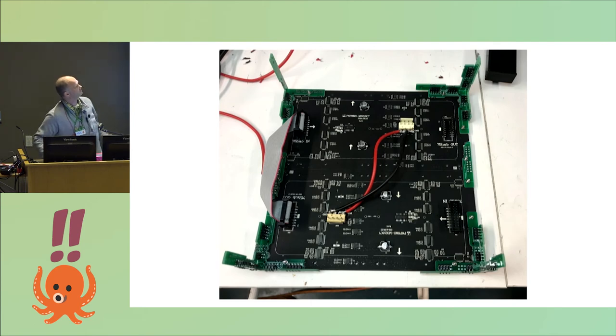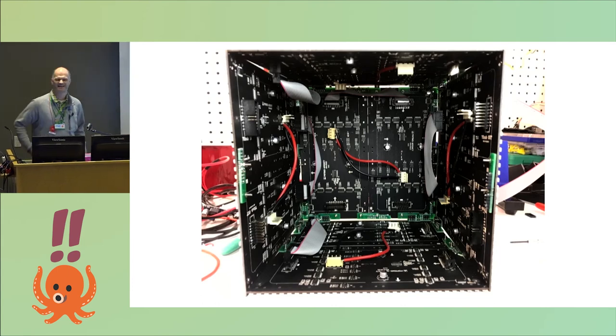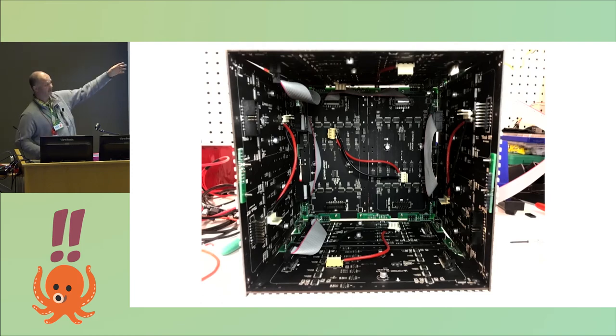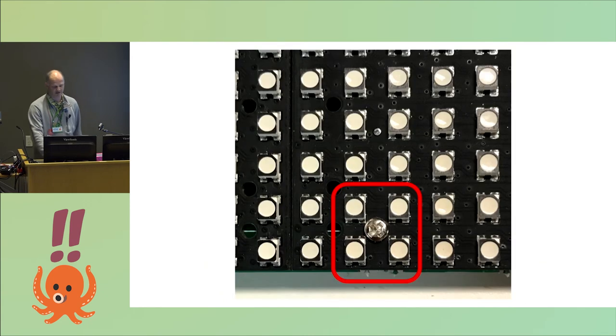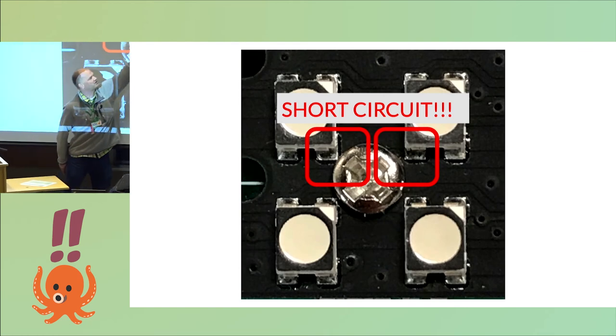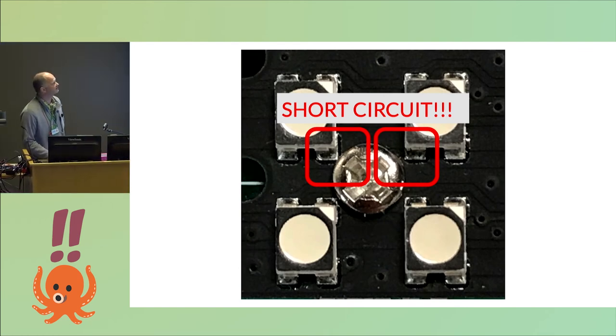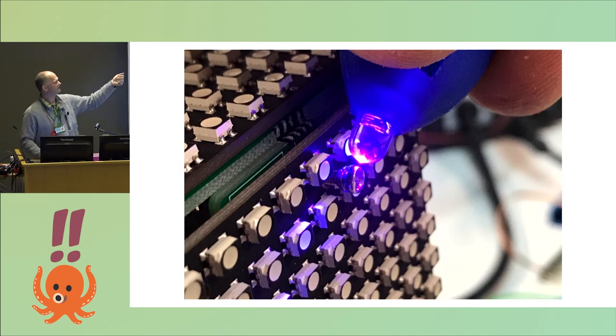You start with two panels and build it up from there — it really gave the feeling of the Death Star tunnel from Star Wars. I only showed you this sequence once, but in reality I did it about four or five times. There are 60 screws in there and it takes hours to get this right. For example, some screws look fine, but when you zoom in, if you really tighten them, you get a short circuit between the screw head and the LED traces. The solution was to use UV-hardening glue that sets in five seconds — putting a little blob on each screw head creates an insulation layer, so you don't have issues anymore.